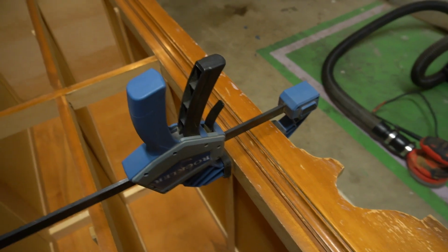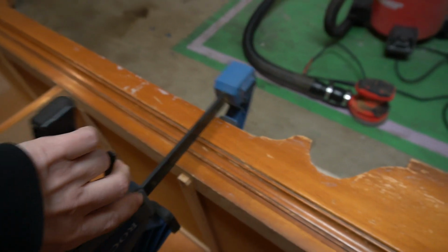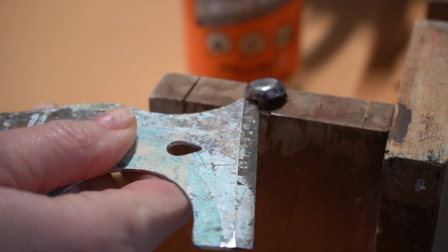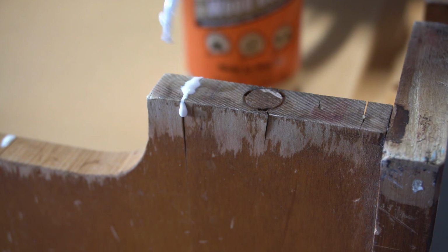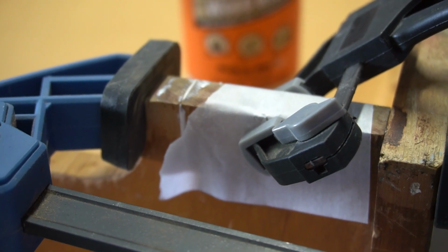I forgot to film everything, but this is the time I started making some repairs, like reattaching this drawer rail, and prying off the feet to assess all the split wood. On some of the bigger cracks, I added some thin, skinny layers of maple veneer to act as splines. You'll see me chisel those out in a minute. I added a generous amount of Gorilla wood glue and clamped from multiple angles to keep things level and plumb. I did the other 3 feet off camera.